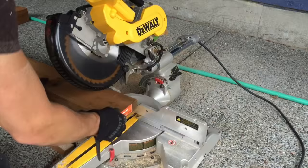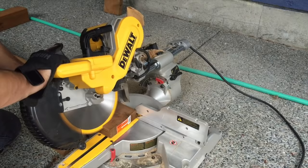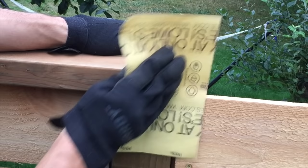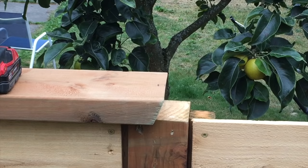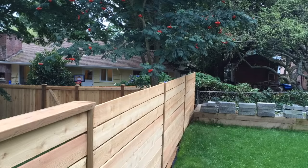The nice thing about this top cap is that you don't have to be too precise with your measurements as long as it's supported by both posts. Also make sure you're checking your lumber for any weird marks and orienting them face down so you can't see them. When placing the top cap, feel free to hammer the end so you know you have a tight seal on the other side. It's also nice to sand the ends so they fit properly. Take a quick measurement on each end to make sure you have even spacing, then pre-drill your holes and screw in on both sides of the post to lock the top cap into place.